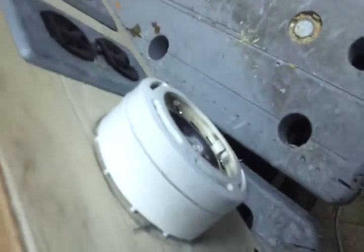So this is what I figured out. I got the wire coming in. This is kind of hard to tell from my phone here. I got one black coming off the outlet in the back. Then I got the two whites coming off the outlet, and of course the grounds are all daisy chained. Then it comes up, this is the master switch here. So I put an additional light on this side so you can tell late at night. So that's wired there.